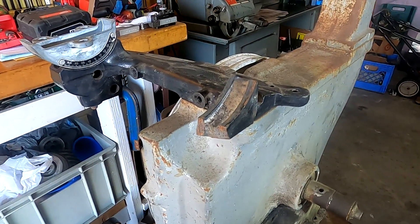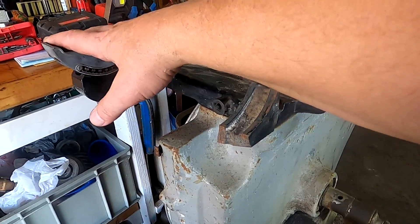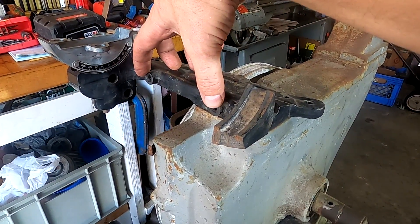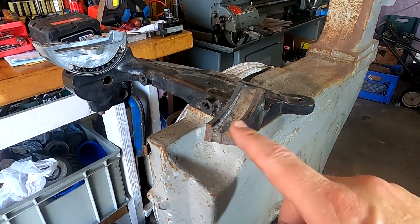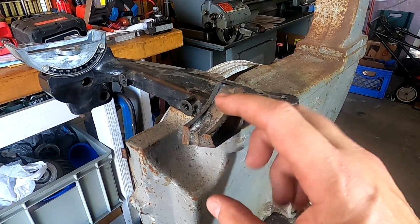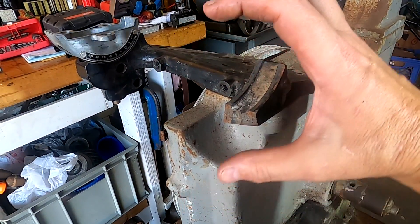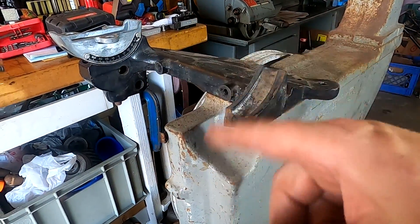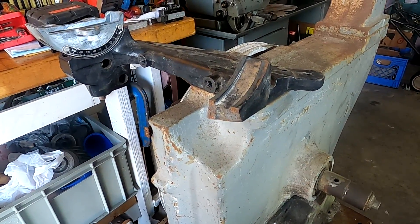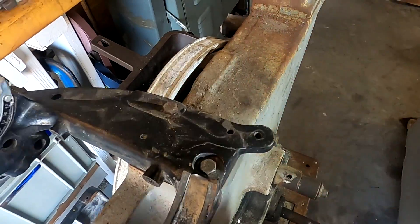Basically, the problem we have is this casting right here. This is what holds the surface plate in place and allows it to rotate or angle, and the blade guide mounts right on here. But this casting right here is snapped off — it should come around like the other side but it doesn't. My original thought was to take a piece of round stock, radius it on the inside, put a groove on the inside, cut out the piece I need, and weld it on. But looking deeper, I can see there's a crack right across here.